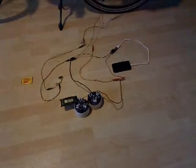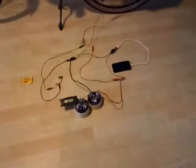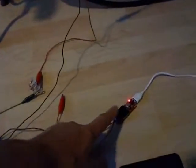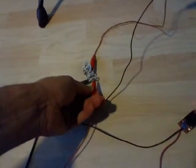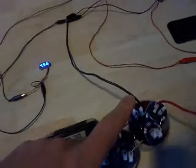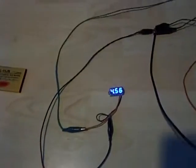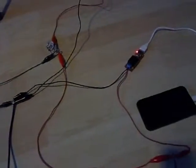It's time to charge it up again. By the way, I am filming this using a tripod — thought you might like to know. The DC-to-DC converter is working well because when using supercapacitors, the voltage is going to drop. At this moment it's down to 4.5 volts, so there's going to be no charging.